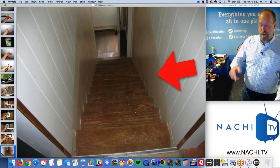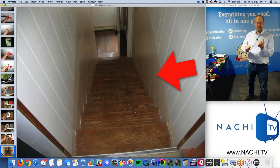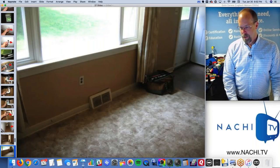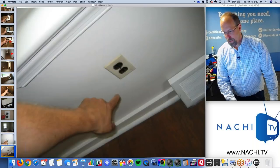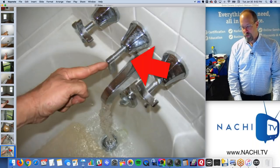And the stairs from the second floor attic, I forgot. I ran upstairs to check the bathroom fixtures upstairs, see if they were connected or at the plumbing, because it's kind of like the kitchen sink. And there's no handrail at the stairs. That's a defect. That's my bag. See my bag, my tool bag, and the things hanging out. I do the first floor receptacles, smoke detectors, windows, doors, floors, bathroom, running water.